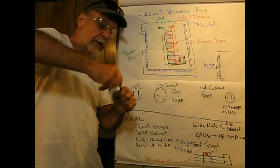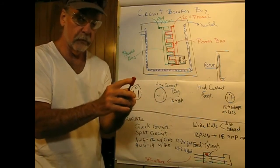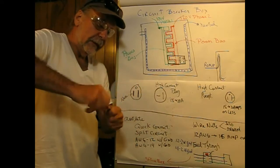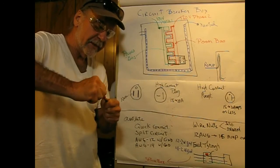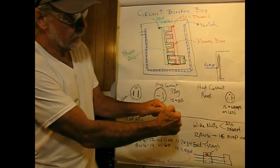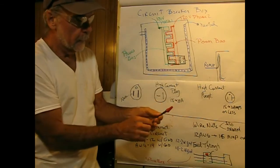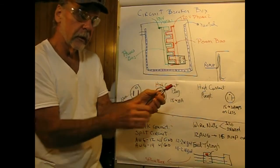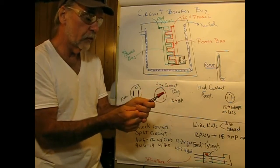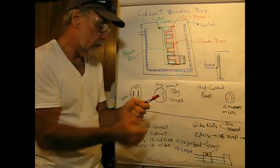And then you tighten it, and try to get wire nuts that have these little wing things on them, some of them around without it, until it really tightens down. You don't have to worry much about stripping this. And you start to tighten this until you see the actual insulation start to tighten. And then you've got a pretty solid connection with regard to this. And the reason these work is because they exclude air. That's where the spring actually bites into the metal.